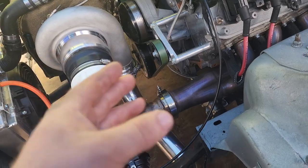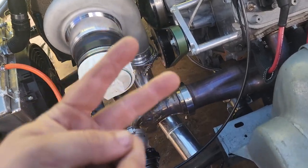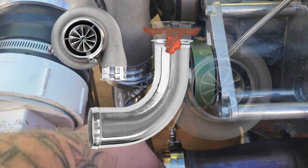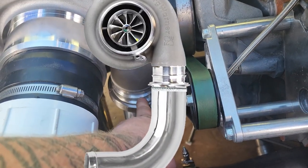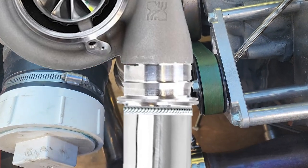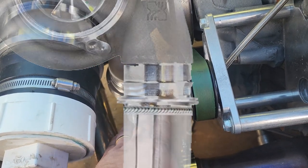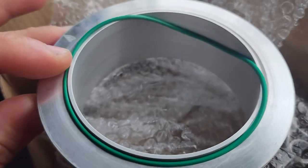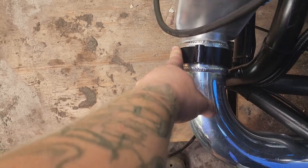It may not be a lot but it's leaking, and every little leak counts. Number two, for the time being we just sandwiched two turbo ends - there's an S400 flange on there and the other side's a turbo S400 flange that was cut off an old turbo just to get up and going. We're gonna put the proper S400 v-band in there so that'll be nice and sealed.